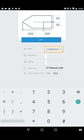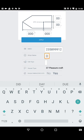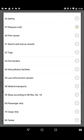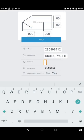Take time to double-check that, then put the ship's name in — I'm just going to put Digital Yacht. If you had a VHF callsign you could put that in this box here. This field is the vessel type, so I'm going to set that to Sailing because it's a yacht.